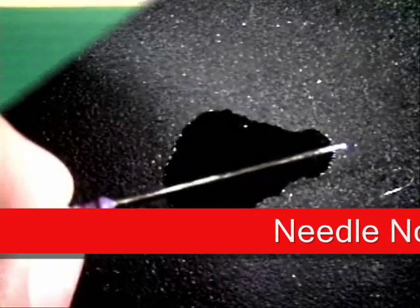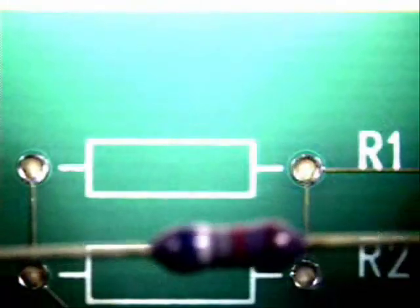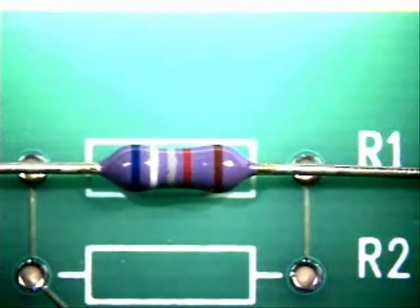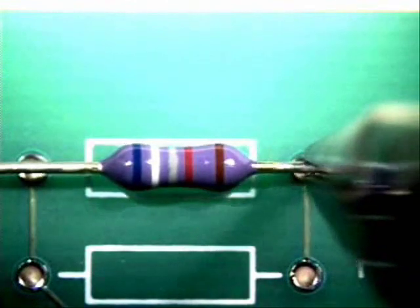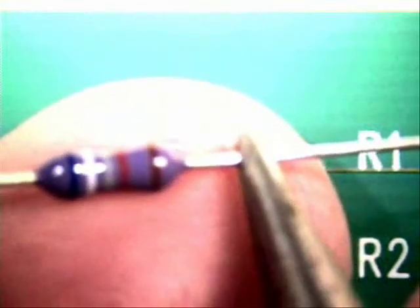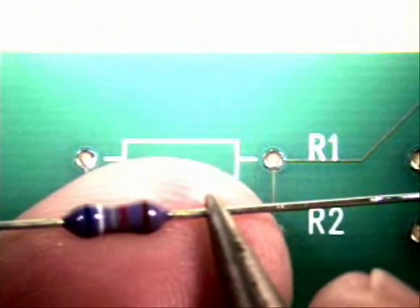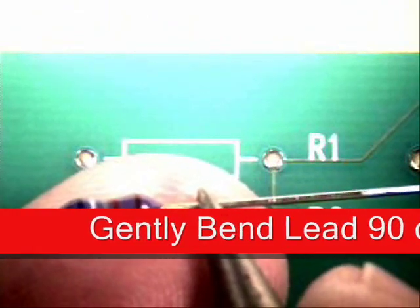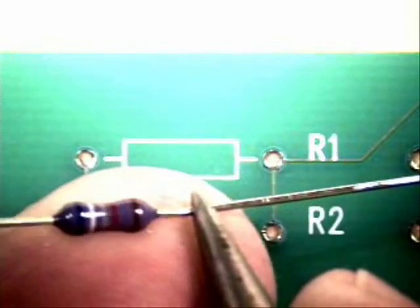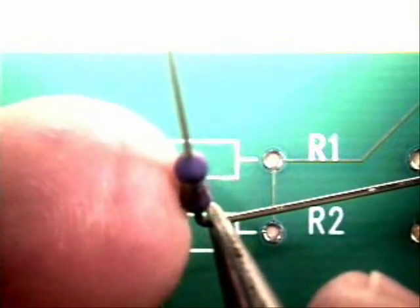What you want to do is come down on the lead itself, hesitate, and then slowly bring it down. That is how you pre-tin your part before soldering. There are two different ways to do the forming — one is with a pair of pliers. I let my component center in the silk screen just like so. I grab that component leg right in the center of that hole. I'm cutting with the side of the face, not the point, and keeping gentle pressure. I put my finger between the component body and the lead itself, right against the pliers in that middle area. Not moving the pliers, I bend it 90 degrees upward just like so. This keeps me from doing any damage to the seal area on the component body.